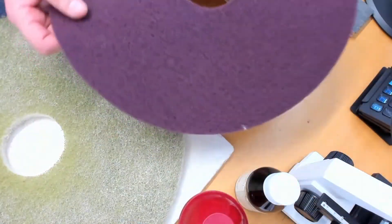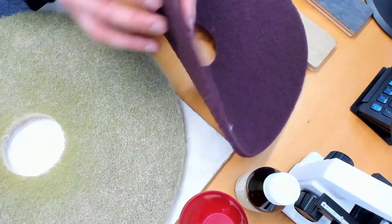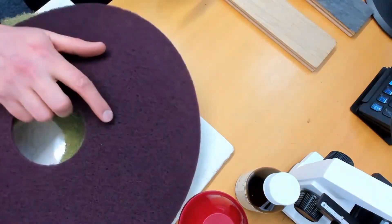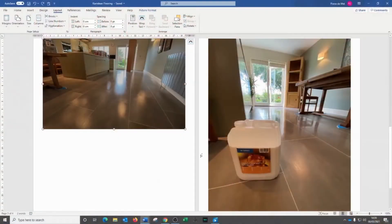What we'll do is thoroughly clean the floor, and then use a special pad like this — it has a very specific abrasion to it, about 320 grit. This will remove any imperfections on the floor without scratching it. Once that's clean and dry, we'll use a special flat mop to apply this dressing over the top, and that's when you'll get the effect you can see here.